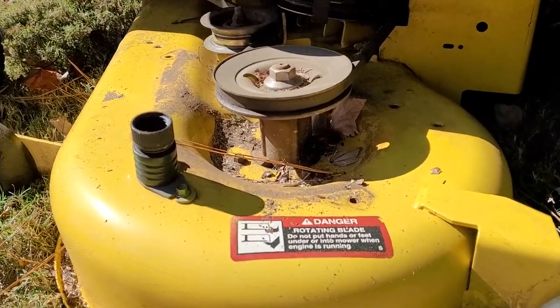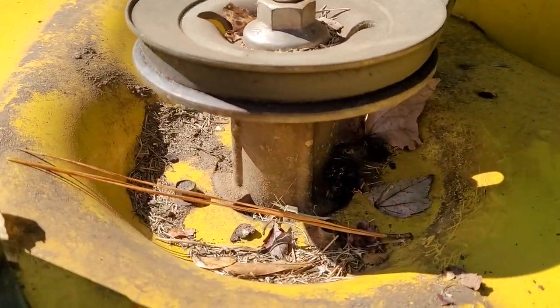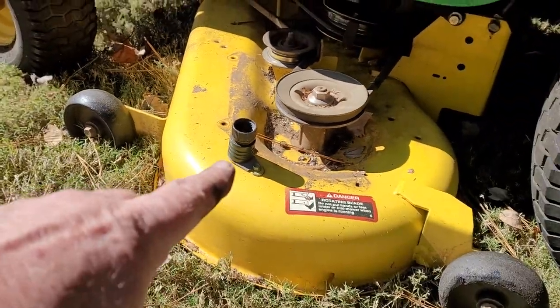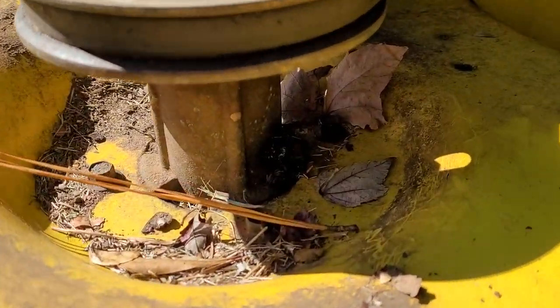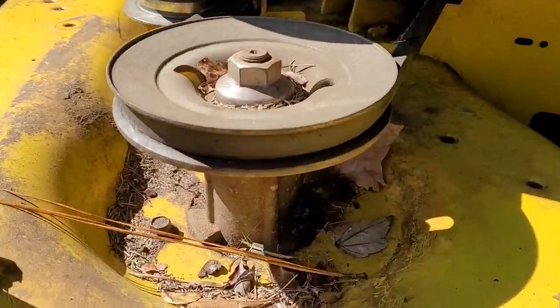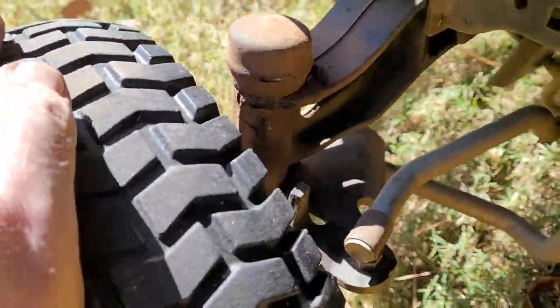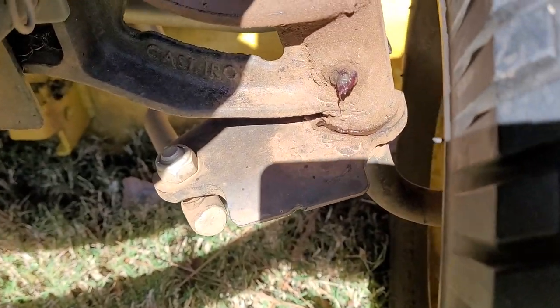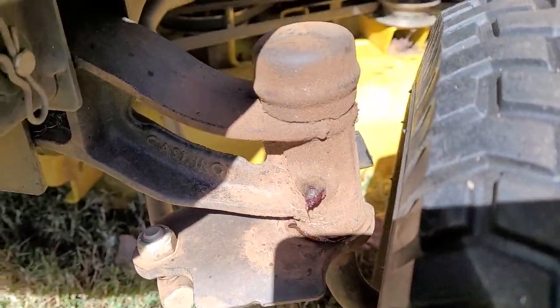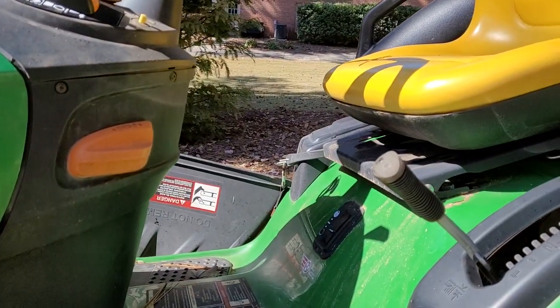By the way, I was doing a little bit more maintenance on this - I was greasing these up. I think these were making noise, a lot of noise. So the spindles is what that's called - so this is the mower deck down here. I got my grease gun out and greased up each of the spindles through the grease fitting there. And then I also greased up here - this has a grease fitting as well on the steering. You can see it right here. So I like to grease those up every once in a while, it makes the steering a lot easier.